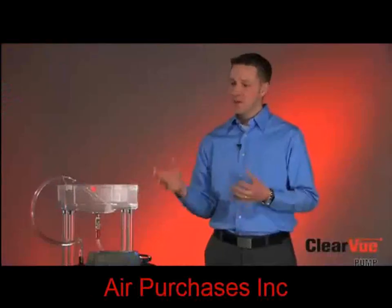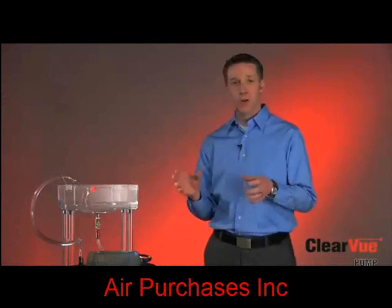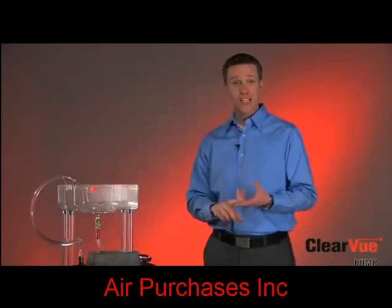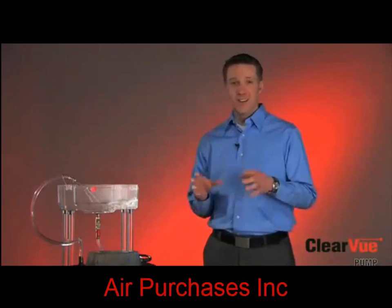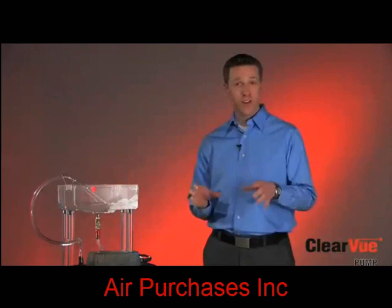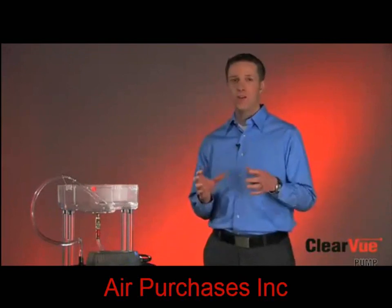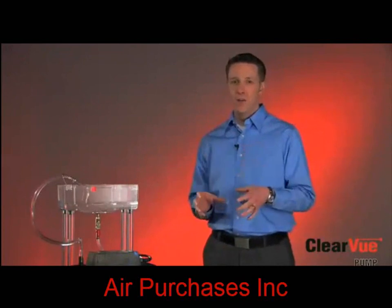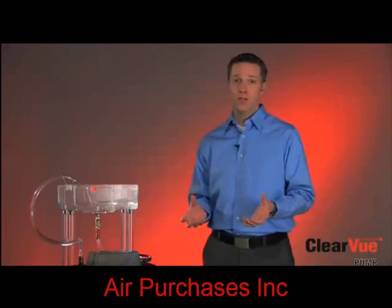As you can see, Clearview is still self-cleaning. Clearview will continue to self-clean, doing that pressure pulsing water hammer feature, until it either frees the kink or removes the clog from the line — keeping your compressor shut off this entire time. Clearview will continue in this mode for about another minute. If it doesn't free the kink or remove the clog, it's just going to go back into that alarm condition, running at full speed, keeping that compressor shut off the entire time, just like a regular condensate pump would do.